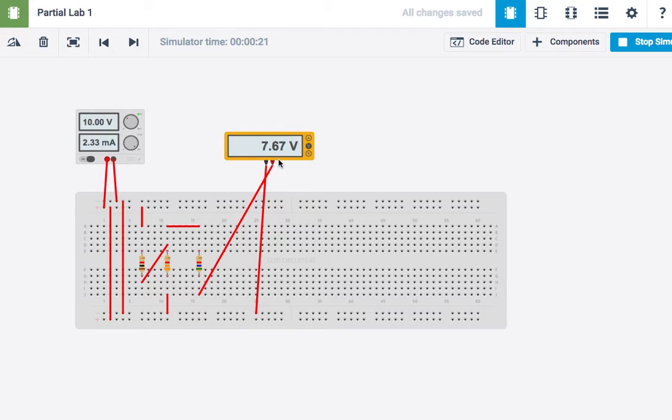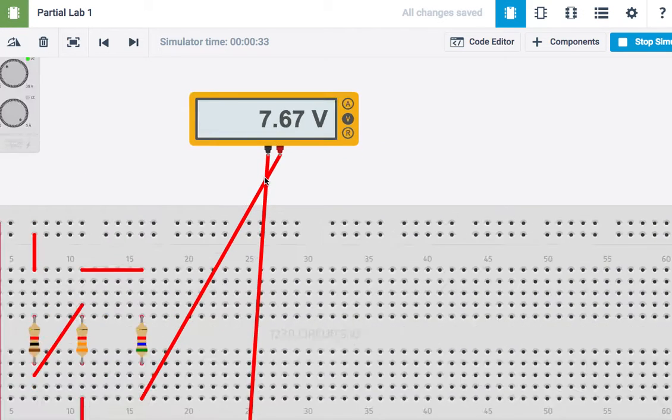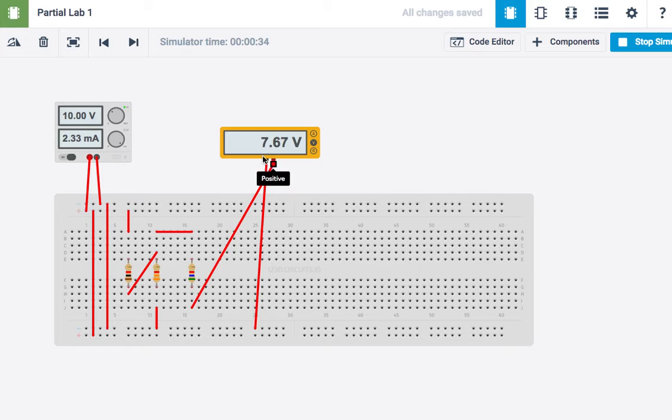multimeter has a very high internal resistance. In other words, in order to avoid drawing current from the circuit whose voltage drop you're measuring, you want the resistance of the multimeter to be much higher than the resistance in the circuit. But the trouble with measuring current is if you put a multimeter in a current measuring position where it intercepts current, but you leave it in the volts mode, its internal resistance will completely swamp the resistance in the circuit, and you will have changed the behavior.